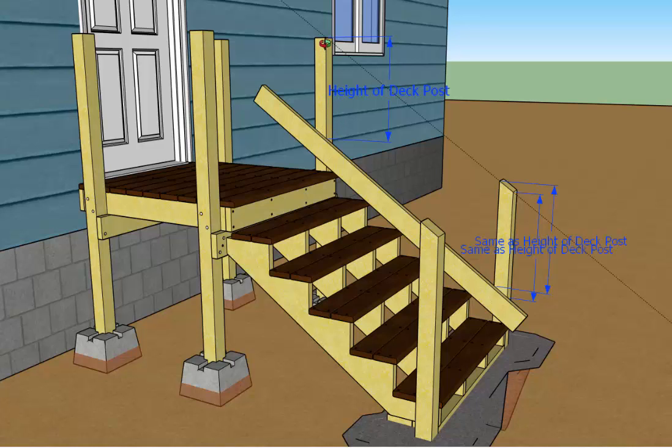Let's say that measurement is 20 inches. You're then going to come to the stair post and, off of the reference board, put a measurement on both sides of the post. On each side, measure from the reference board up — if it's 20 inches, put a mark at 20 inches on both sides. You're essentially creating a line parallel with the bottom edge of the reference board, giving yourself a couple of marks to draw a line so you know where to cut that post off.